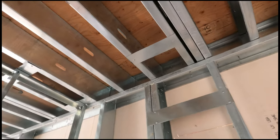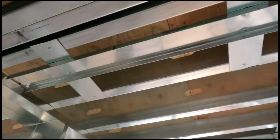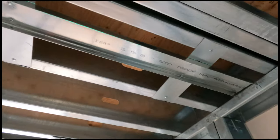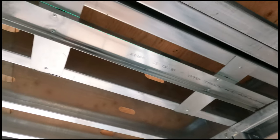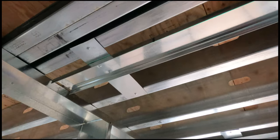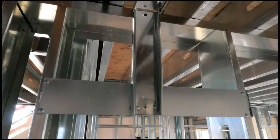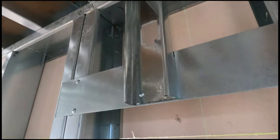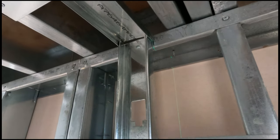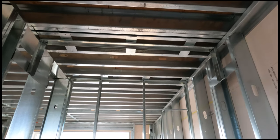Get all your clips in where they need to be — you can see every two feet on the top track. I have one on the wall side and I'll be able to screw the top of the stud into the top track on the adjoining walls, which you'll see in a minute. I like to keep it all screwed in so it's super strong, and just cut my drywall all around it. It just makes for a better, stronger bulkhead.